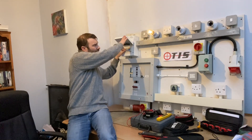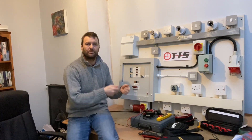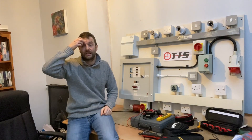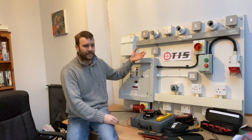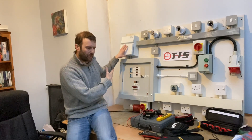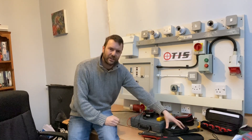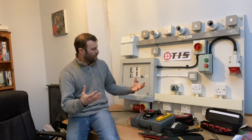You're then told to seek permission, switch the circuit off, and then perform safe isolation — proving the voltage indicator, that's the GS38 test, prove it's supplied, prove that it's dead with it all locked off. There should be a lock on this; I do have a range of locks here, and you go through that system. I do have a video by the way to prove that I know how it's done.